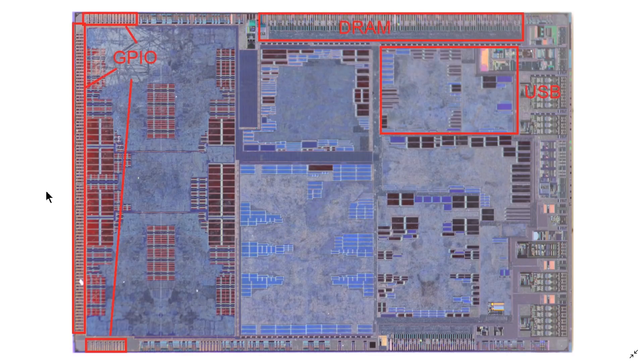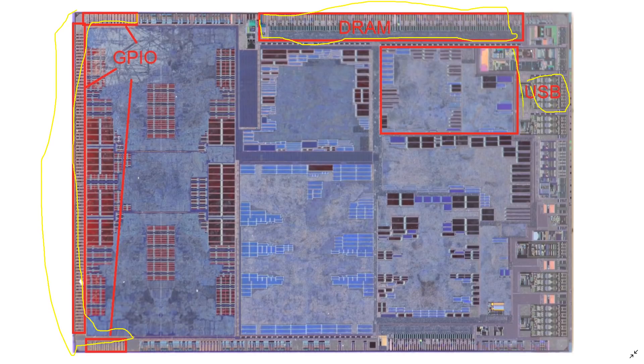There's a lot of IO - I think about 40 IO with the Raspberry Pi. IO pins don't tend to require a lot of IO cell size, and there looks like about 40's worth here, so I suspect this is the GPIO on the left-hand side of the chip. Up here is a DRAM controller - DRAM is a very specialized IO cell requiring fair speed. That would leave here a USB function - it's differential in nature, which would imply that a lot of the peripherals for the chip actually sit in this block here.